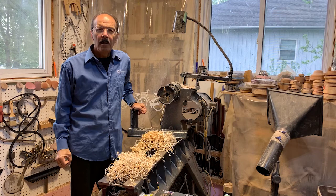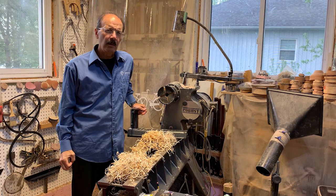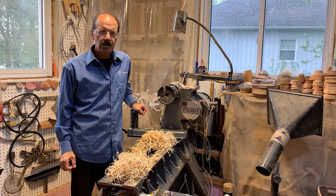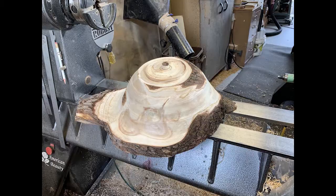So that concludes part one of my video. Because the piece is wet I need to let it dry for probably a month, because cedar should dry pretty quickly. But what I will probably do at the end of that month is put it in a box or garbage can and put a bit of a makeshift kiln together — just heat it up and leave it in there for a good three or four days to make sure it dries all the water out of it. So stay tuned for part two. These are just a few photos of the roughed out piece.